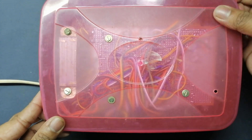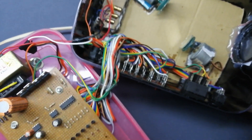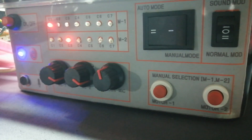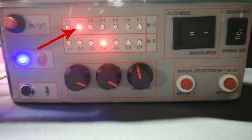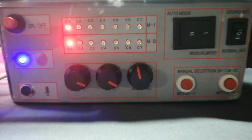To set up the laser patterns manually, follow these steps: open the projector enclosure. Here you can see the laser projector controlling circuit and transformer placed on the upper side of the plastic box, and the laser diode and two DC motors placed on the lower side. The laser projector is currently on auto-changing mode — change to manual changing mode. Now you can see both channel LEDs have stopped, with first channel LED on second position and second channel LED on fourth. Set both channels' LEDs to first position.